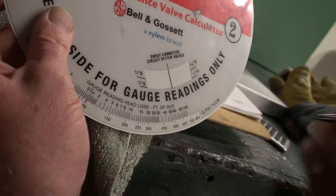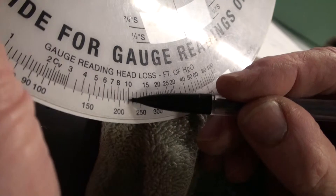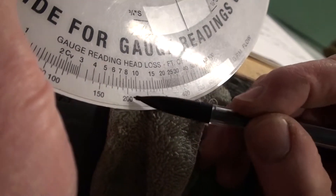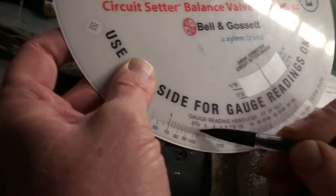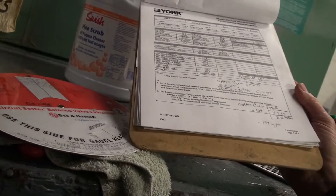This is very close to what we had on the wheel. The factory told us 218 GPM at 9.9 to 10 feet. We don't have 9.9 — we only have 7.5 feet — which puts us at 190 on the wheel. And 190 is very close to 199 from the formula. The wheel is also showing a CV hash mark down here indicating about 110, and when we did it mathematically we came up with 109. So the wheel is a pretty good match.